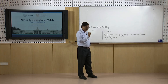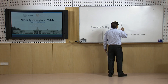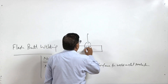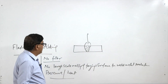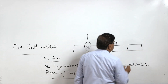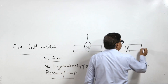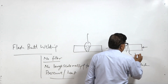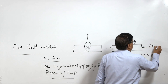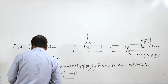Unlike other welding processes that mainly rely on heat to bring faying surfaces to the molten state — through arc or gas flame — where solidification under gravity achieves metallic continuity, in this case heat is used for increasing the temperature of the faying surfaces to the forging temperature and pressure is used for the forging purpose. Heating to the forging temperature and pressure application for forging the members to be joined achieves metallic continuity.